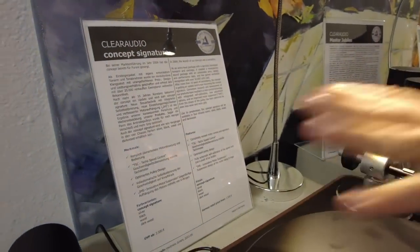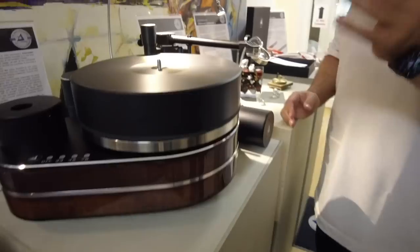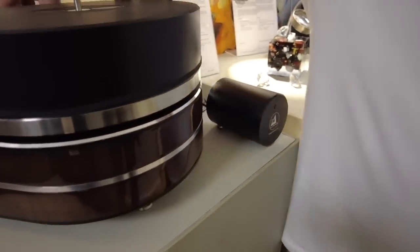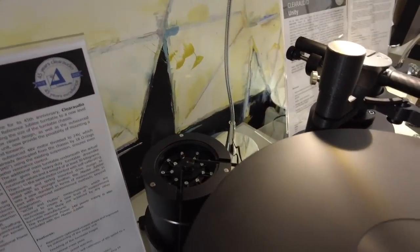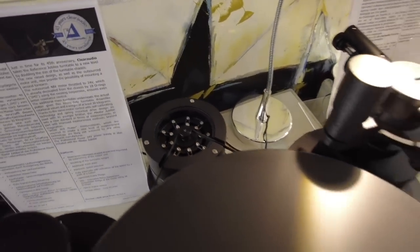A lot to see. And of course our massive Jubilee 45 turntable, that we will call the Master Jubilee, double plinth, thicker platter, outboard engine, the same construction with the rubber belts, even more sophisticated motor control with a digital analog board, but with the optical control, which is even finer in resolution than on the tachymeter, on the tacho speed control.